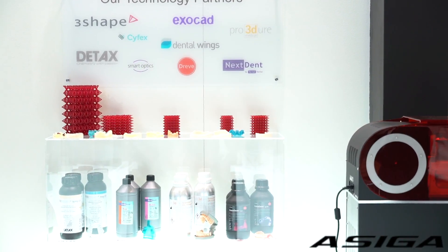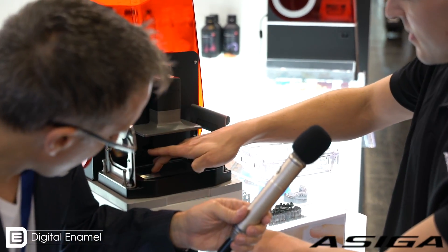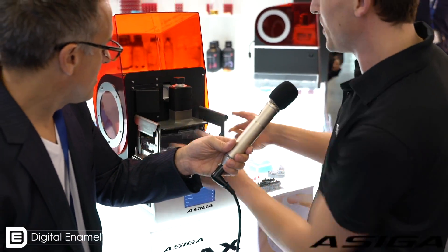We're looking at the Asiga MAX. We do have an intelligent positioning system — we call it the smart positioning system. This glass plate is not only a glass plate; we use position encoders to actually know what we're doing. Where I touch on the glass you can see it's like a touchpad. It's decalibrated right now because we've been playing around with it, but you can see it's noticing what I'm doing. This is actually knowing where the platform is, when we squeezed out material, when we separated. It can even tell you when you need recalibration, when you need to fill up your material, and we can increase speeds with this. We monitor so much of the process that we can increase speeds quite a lot.